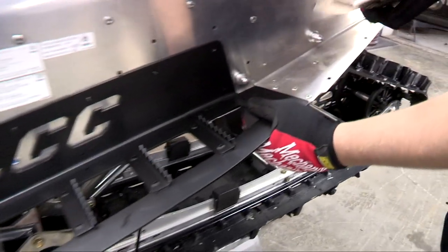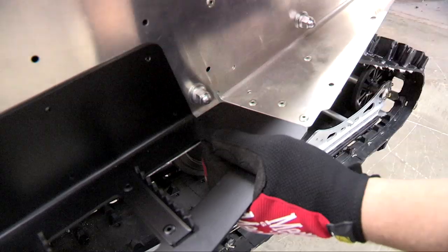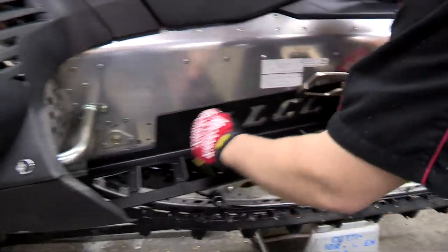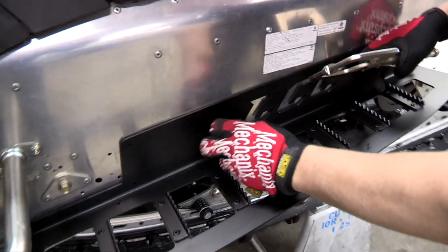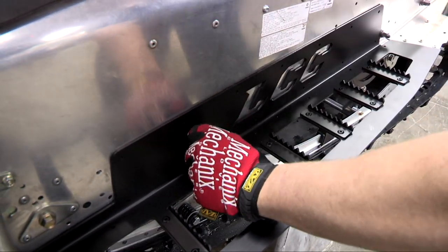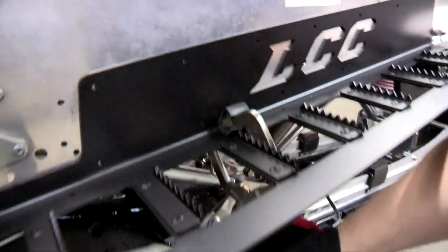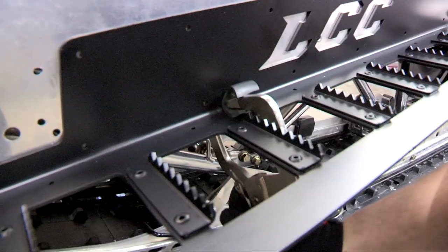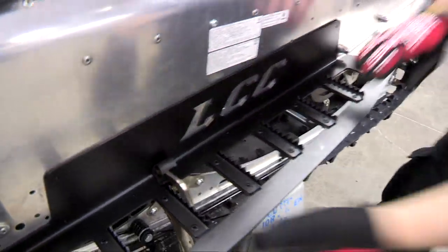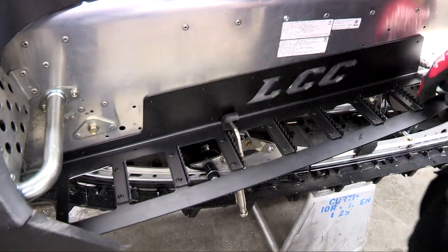On step 7 of the Yamaha, when you're getting ready to clamp, make sure that your line is set. And then once that is, take your piece of hose or piece of rubber so you don't scratch your powder coating. Take your hose clamp, and you want to make sure you suck it up against the tunnel. Just like that. That way it's in place and ready to start drilling out the holes for the rivets.